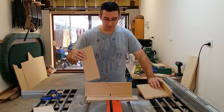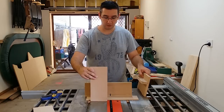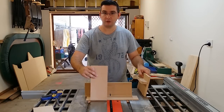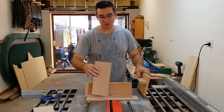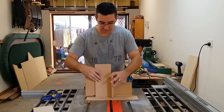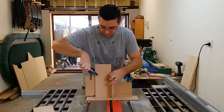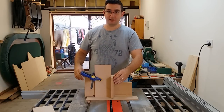You might notice that in the first video I used a metal ruler on the table saw to offset my workpiece from the top of the table so it doesn't drag. Instead of using the metal ruler, now I use a piece of MDF, simply because one day I might forget to move it. So put that in like that, and that's it - we're all set to cut.